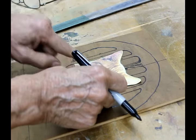So what I'm going to do here is I'm going to mark right where that's going to go. Okay, that's going to look good right there. Now we're going to make it symmetrical. So I'm going to put the volume control knob on the other side exactly the same place. See, I've extended the wires for the volume control wire here, and we'll just mount that potentiometer there and then solder the wires onto it. And then the speaker will mount up here in back of the cat. Okay, now the distance here, about like that. Okay, those are going to be the locations for the controls.